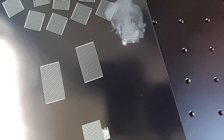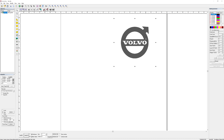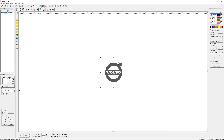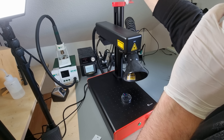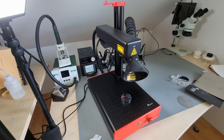Let's see what we can do with some of the normal materials delivered with the machine. Normal Q-switched fiber lasers can basically be configured through scanning speed, power percent, and pulse frequency. Now this MOPA technology comes with a powerful new parameter: pulse width. Honestly, this many degrees of freedom — some with correlations — are a bit overwhelming. But there is a quick-start mode. If we just want to noisily zap material specs away from a surface like a Q-switched fiber laser, we can imitate that technology's normal parameters: say, a 50 kHz pulse rate, 100-nanosecond pulse width, and power and scan speed to taste. Then we just position our workpiece, pull the trigger, and we're on familiar ground.